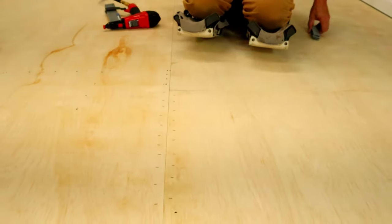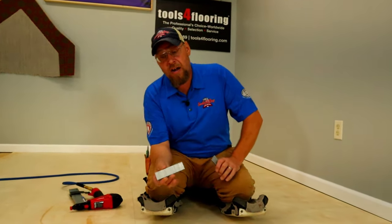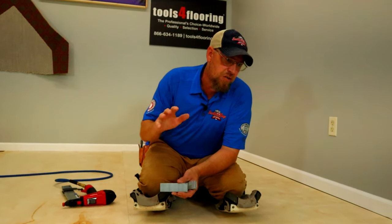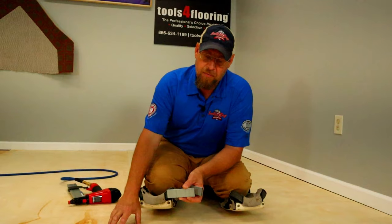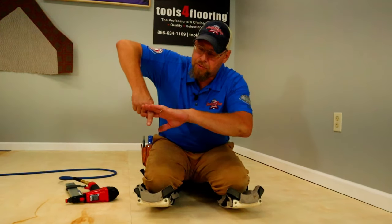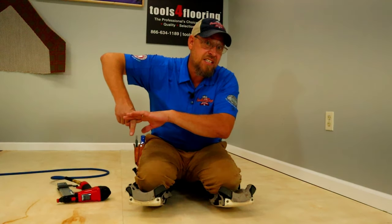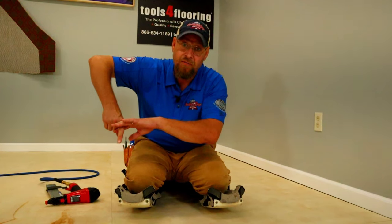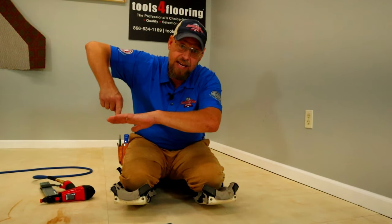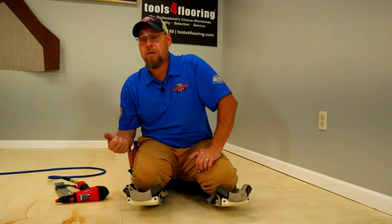There's something I want to point out about the size of your staples. These are actually an inch and a quarter — I just finished a job where it had two layers of subfloor, so that's fine. Typically you want to use about a seven-eight staple, three quarters of an inch, depending on how thin a product you're putting down. When you shoot your staples, you do not want them to protrude out the bottom of your subfloor — if a staple goes all the way through, it completely loses strength. You want your staple to end inside of your board for the most strength and best bite.